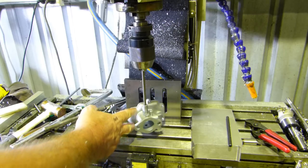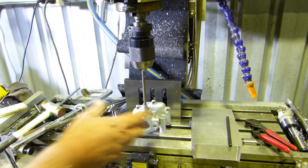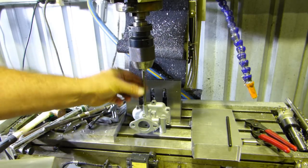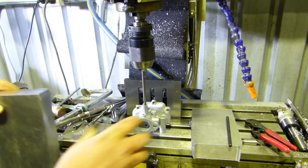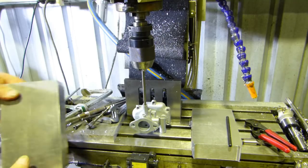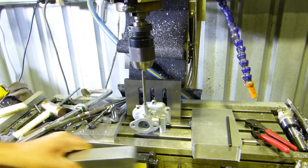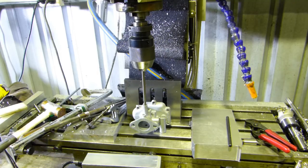So once we bolt the top of the carby to the plate here, then we just need to put the ream in, make sure it's okay, nip the bolts up, and then we're free to bore the housing. So next step, we'll do some boring and tapping.